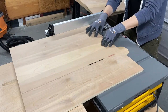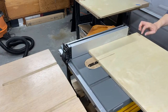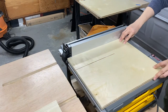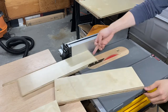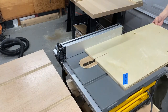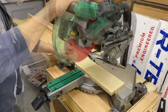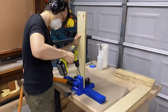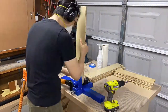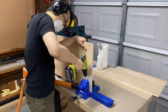After cross-cutting the plywood to manageable size, I use the table saw to rip it to final size. For the drawer sides, I continue to use 3/4-inch plywood as the drawer spacing requires accurate size and I don't want to change my design. Building drawers using pocket holes is really easy and is by far my favorite method. The idea is to connect the drawer front and back to the sides using pocket holes. When the drawer front is attached, the pocket holes will be hidden. Similarly, for the drawer bottom, the pocket holes will be at the underside so they won't show either.